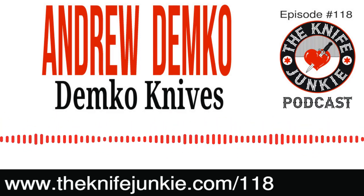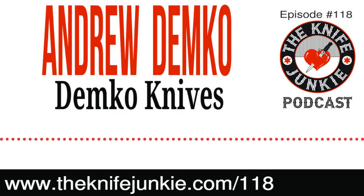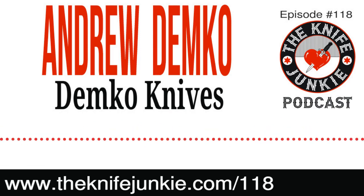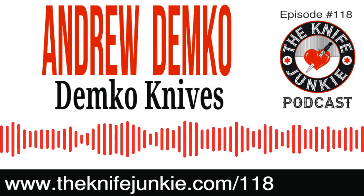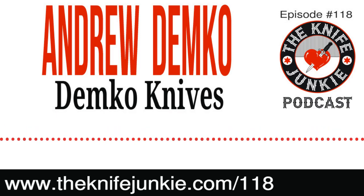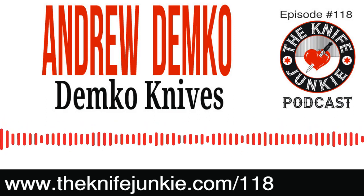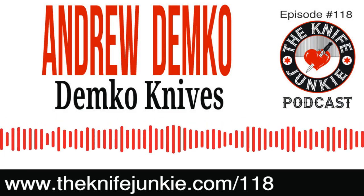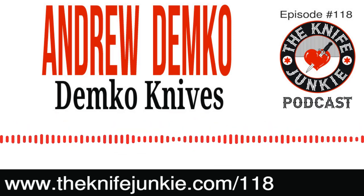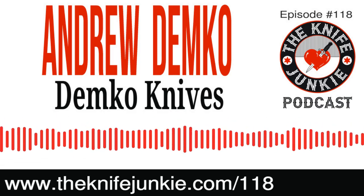I also changed the jimping on top. I put some really great jimping on all those blades because they're wire cut, so I could really take advantage of the wire and put jimping that was pretty amazing — something you're not going to do on a CNC mill. Kind of like the real fine jimping between the large jimps on the custom 80-15 and 80-20. Those little jimps in between the big jimps are very fine and grippy — you could use them like a fingernail file. That's stuff you can do on a wire because the wire is only five-thousandths of an inch in diameter.